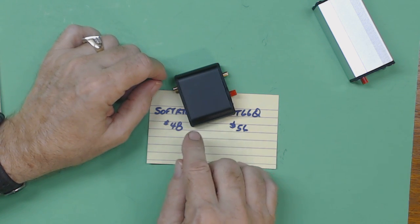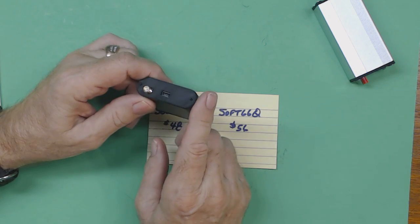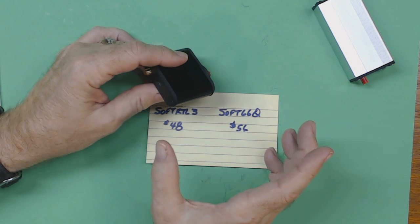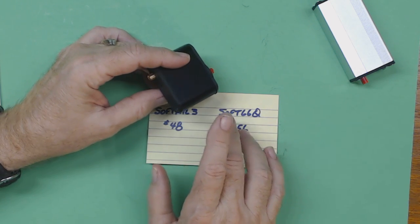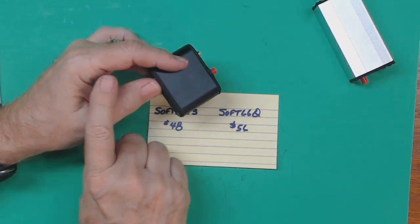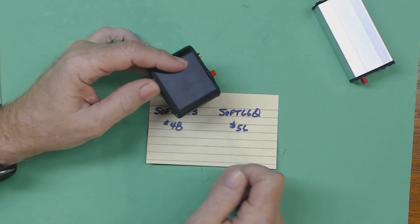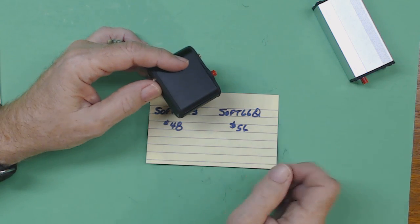Like one I saw, it was just a spectrum display. So it was using this basically, or one of these, as a spectrum analyzer, and it just showed you graphically where it scanned this huge spectrum band and what it found. Now, a lot of the programs, such as SDR Sharp, for instance, don't really give you that capability of just continuously scanning the entire bands. They usually just show you a segment of the band that they allow, which is a couple of megahertz bandwidth, and you have to manually move it.